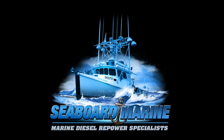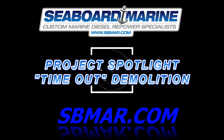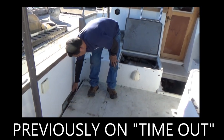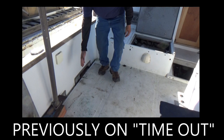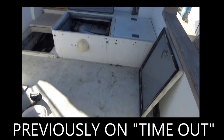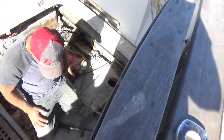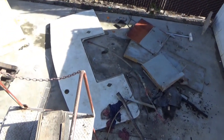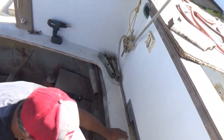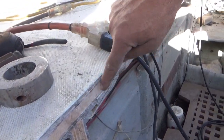All came out of this boat. To get the engines out we had to cut the whole deck off — going about six inches from right here all the way around the whole side of the boat, taking the whole thing in one piece. Day one cutting into the deck, got a lot of it chopped out already. There was a tank right here, and there's the deck — there's a water tank. It's going to be seven inches from here to here. It's a special wood for the stringers, not plywood.